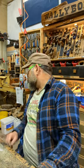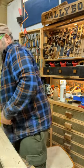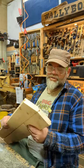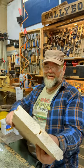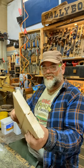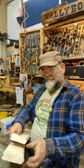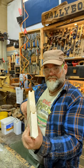Oh, you were building your door for the barn earlier? Well, that is a volet lame board here in France. If I show you close up, you'll see. Here is one, and here is another. Basically, it's a tongue and groove board. We can't get them in the UK, but these are very common here in France. The beauty about them is they've got a shallow tongue and groove. You could use floorboarding if you like. The beauty about that is it can move, it doesn't grip too tightly, and they can expand and contract without any resistance. So it kind of makes sense, and that's what we use here for things like that.